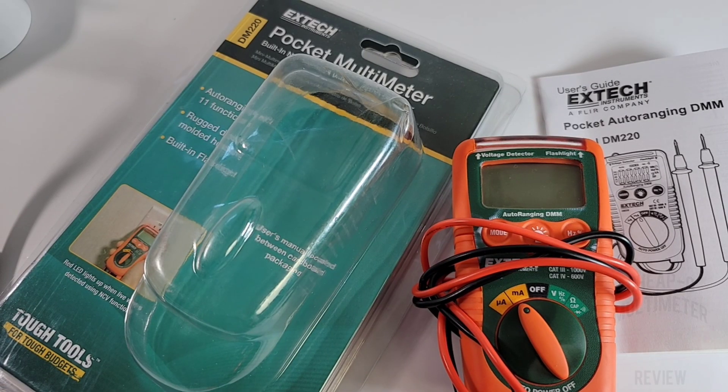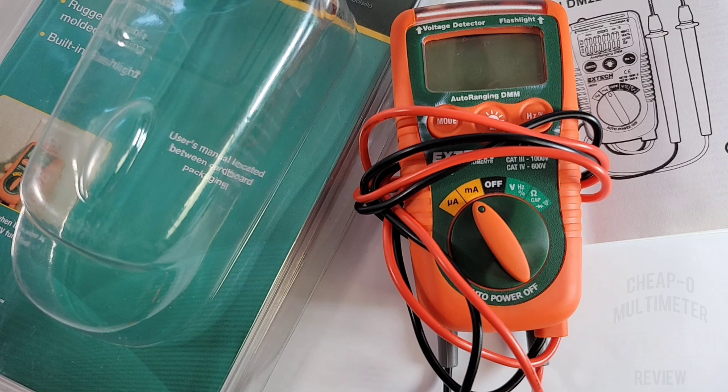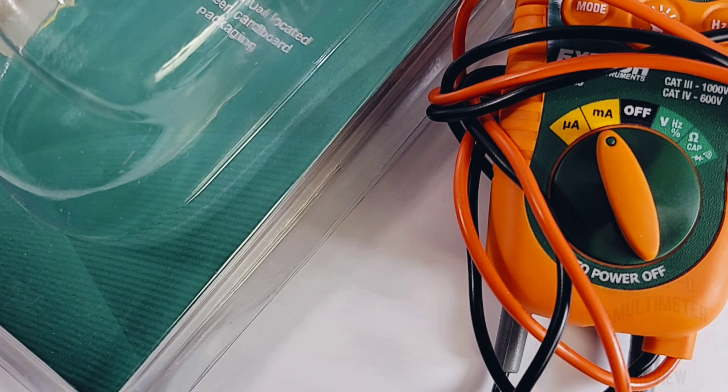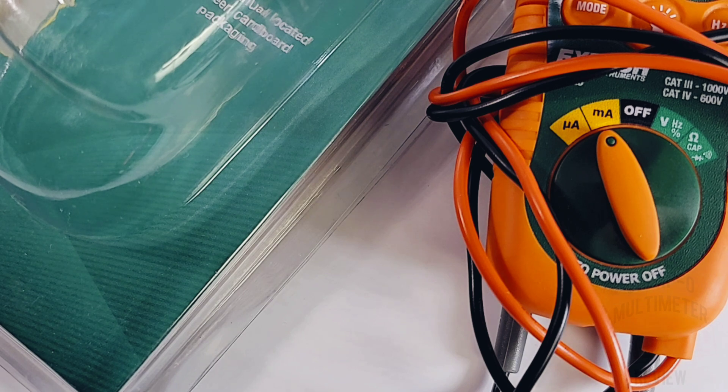Closing thoughts for this little pocket rocket from Extech — the DM220. This is one great little pocket-style mini multimeter that has actual robust input protection and should fill a definite need. The Extech glowing orange color is so easy to find, no matter how messy your garage is. Great performance: 600 volts AC/DC, duty cycle, frequency — it does the stuff you need it to do. It doesn't do high current, but it does milliamps up to 200. I wish the screen were a little bolder, brighter, and crisper, and a backlight would have been nice, but at the end of the day it's still readable. The Extech DM220 gets a solid 4 out of 5 stars. Throw this one in the toolbox or out on the camping trail and you'll be all set. Thanks for watching.